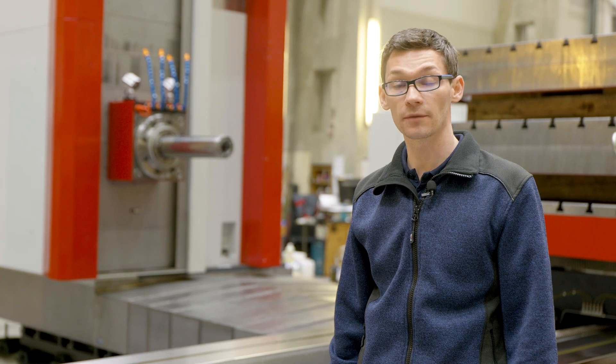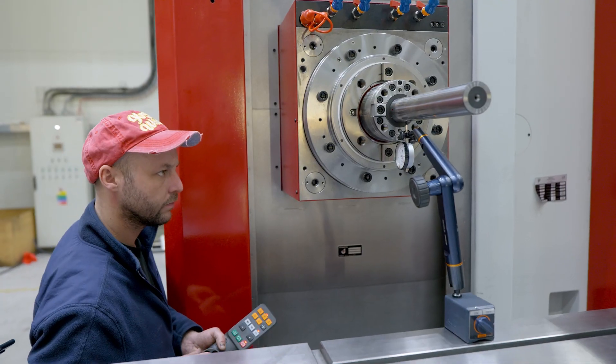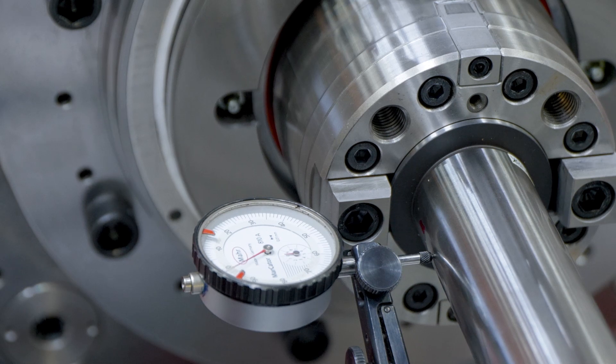For a standard precision of boring mill, you can use some kind of warm-up cycle at the start of each day, or your operator can increase the number of measurements before finishing operations. Both approaches may take up to 100 hours per year from your machine capacity in total.